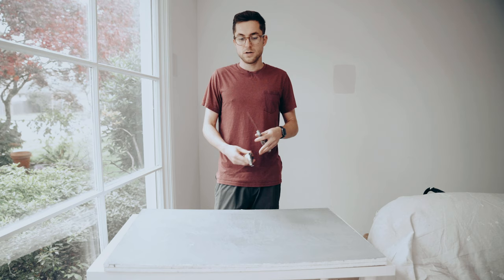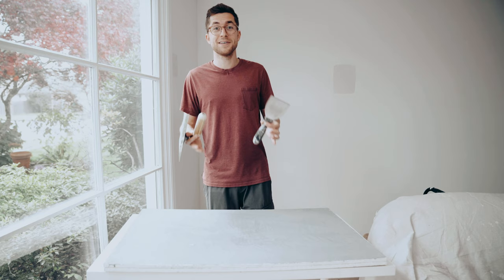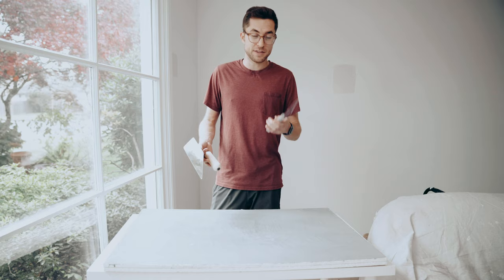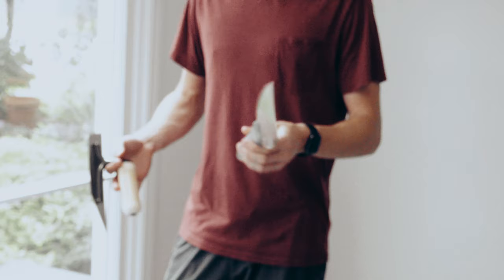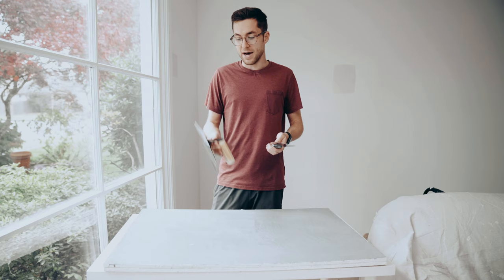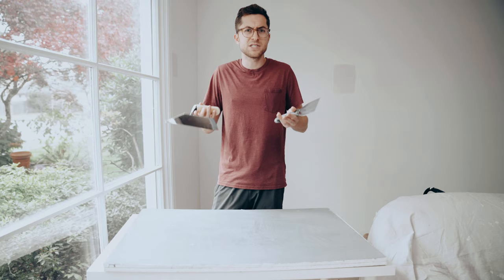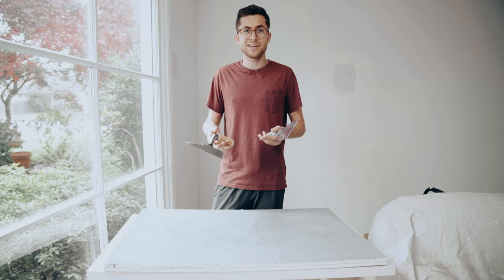If you're applying directly to your wall and you haven't really practiced, that's going to be more difficult. So I always recommend grabbing a board at any hardware store — that's a good way to practice. Buy a little bit of Venetian plaster and learn the basic techniques of applying it. The two tools you're going to need are a little joint knife — this is a four-inch joint knife — for getting your plaster out of the bucket onto your trowel. Your trowel is what you'll use to apply. There's not really a specific trowel you have to get.